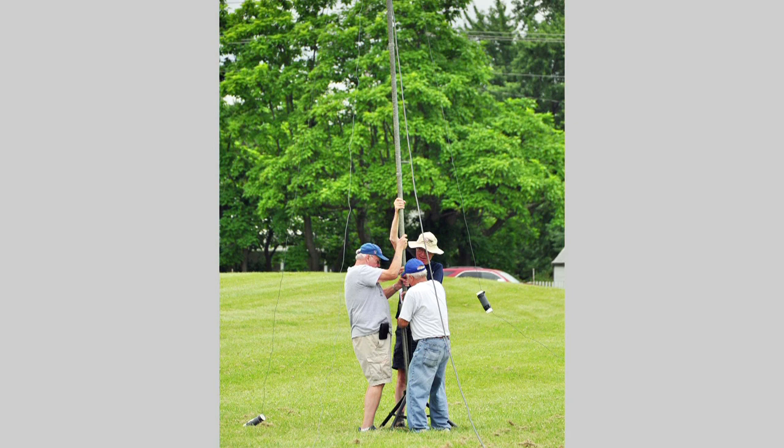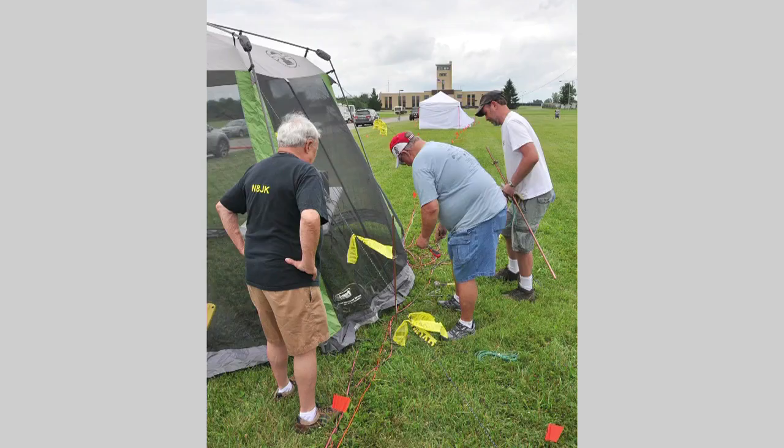So this is just a push-up mast. I think there's Denny, Mike, and Gary. Our Gary is KDV, and Dennis's call sign escapes me. Anyways, it's a push-up mast, and we're setting up here, I think, the 40/80 NVIS antenna. Okay, and that's like a dipole, except it's got traps on either end there? Correct. That's 40/80, because it's loaded. And we're going to set it low for NVIS local communications for that one.